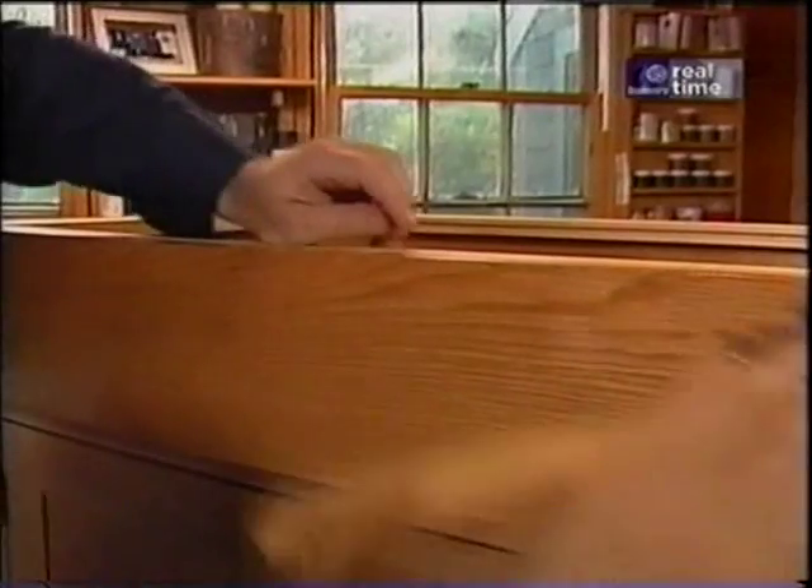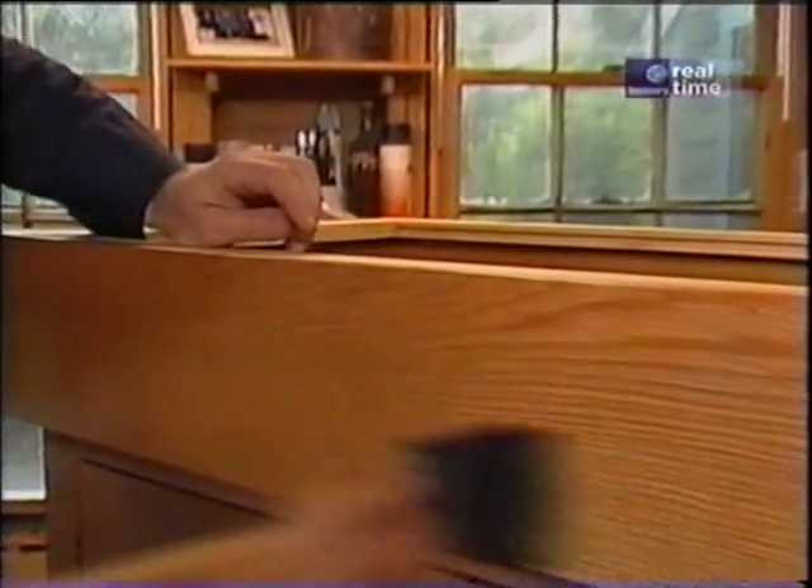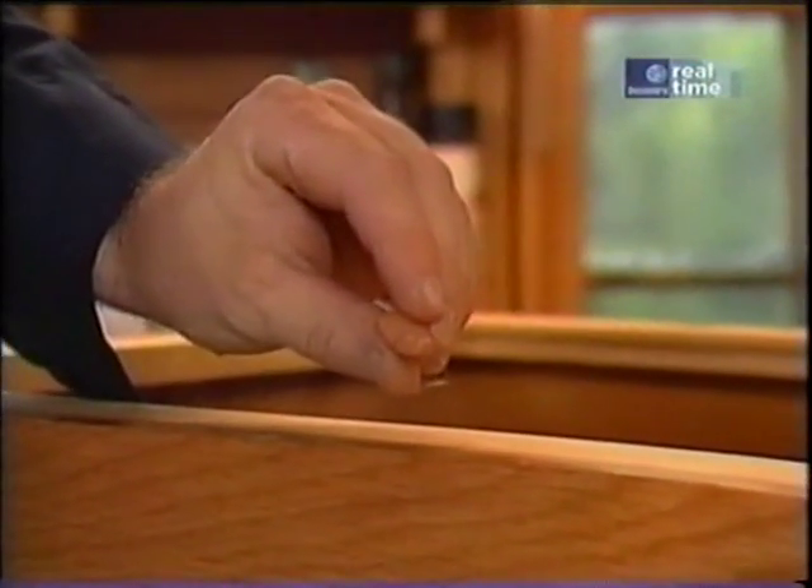I'll put on three coats lightly rubbing between coats with steel wool, and that should give me a really durable finish. With the first coat of polyurethane dry I did a very light sanding, then found an appropriately colored putty to fill the nail holes. And now I'm putting the final coat of polyurethane on.